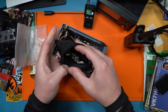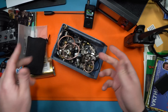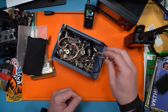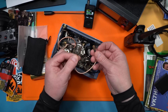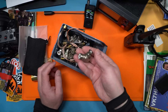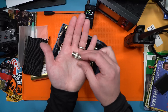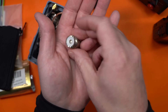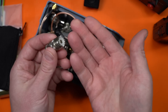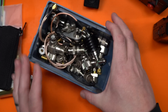I have this little zip pouch that I like to put BNCs in when I'm on the go — it's got a clip on the side so you can put it in a backpack. Really just an assortment of all kinds of stuff. I've even got an attenuator in here for running a spectrum analyzer. I use this a lot to go from a coax connector like my LMR-400 in the shack down to SMA. Most commons are going to be BNC converters. Probably the one that everybody should have — and you should get multiples — is the SO239 to BNC male. That's the one you'll use most often to go from standard coax to a BNC connection for a QRP radio. Buy five, highly recommended.